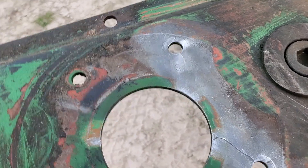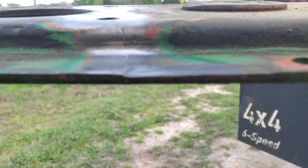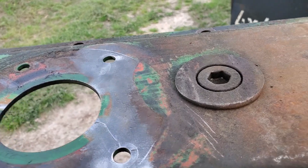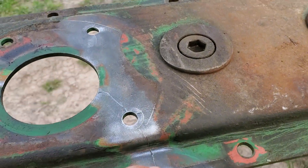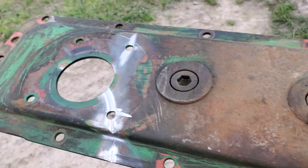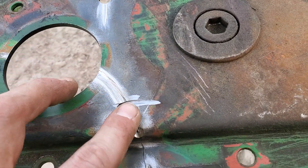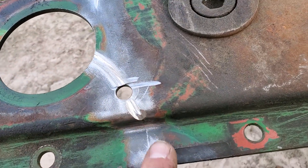What I'm going to do is take my angle grinder with a 1/8 wheel and I'm just going to barely score into this. This is thin — relatively thin material, maybe 3/16ths thick. I don't want to just blow straight through it because there's a gear on the bottom side here that I don't want to get into. So I'm going to just score this mainly to help me see what I'm doing. There's not much I can do in this corner right now because I don't have my die grinder with me. You can see that I've already gone through and ground these out, gouged them out, and went ahead and re-buffed what was there because I don't want a bunch of grinding dust in it.